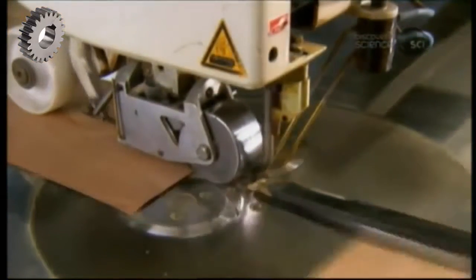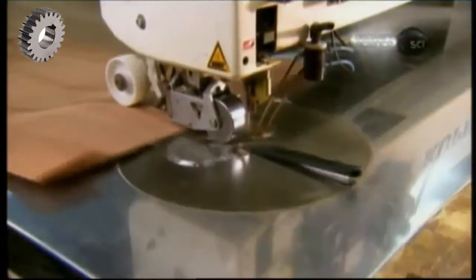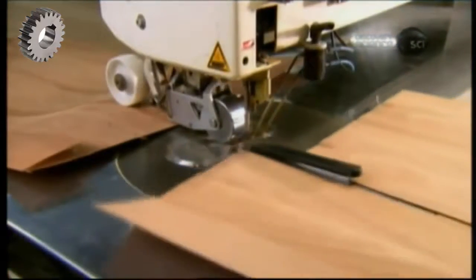The wood veneer for the core's decorative facing is very thin, barely more than half a millimeter. To create a pattern resembling a hardwood floor, they join 2 strips at a time with a wavy thread of glue. Next, they join the 2 mated strips to 2 others, and so on, until the assembled veneers are the length and width of the plywood core.